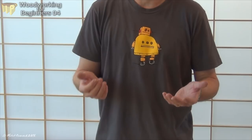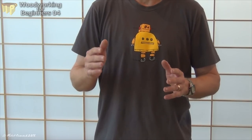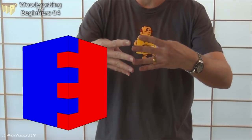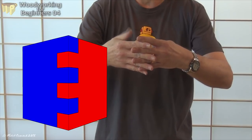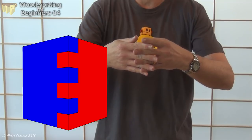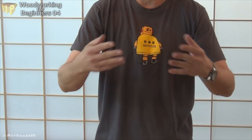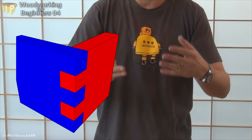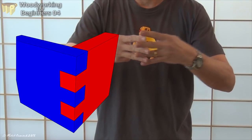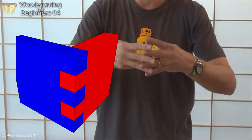From a design point of view, the most important thing is how many pins you have in each joint. If you have an even number of pins — say four — you're going to have a gap at the top of one board and a finger on the bottom, and the other board starts with a finger on top and a gap on the bottom. I don't personally like that, so I go for an odd number: three on one side, four on the other. That way one board has a pin both top and bottom, and the other has a gap both top and bottom.